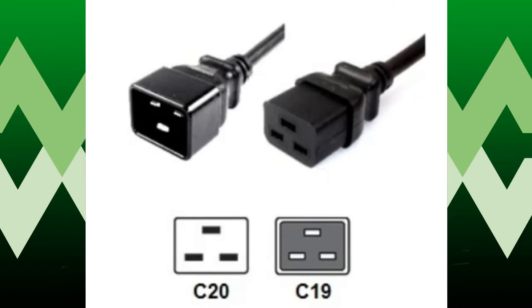The M30S units shipping to the Americas actually come with a cable. Most competitors don't include any cables, but the M30S comes with one. It has a C19 plug for the miner itself on one end, and a C20 plug on the other end. That C20 plug connects directly into any of the new PDUs — most new industrial power distribution units are ready to go, and any data center anywhere in the world already uses C19/C20. So we're going from homebrew power plugs to data center power.